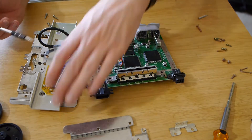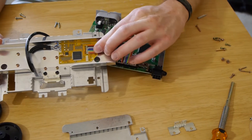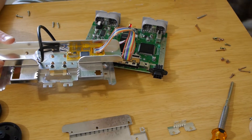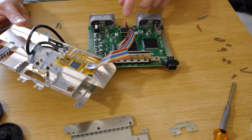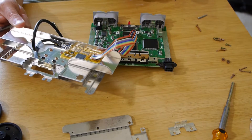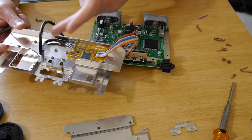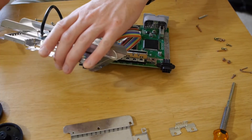The next step is to solder it in the same fashion to the actual N64 RGB board. I've already done that here, of course. Normally you would do this with the board outside of the N64. And then the final step is to solder the board to the multi-out jack. So this is an all-digital connection — this is where the analog connection starts happening. If you've seen my comparison video, you might understand why I tried a better-shielded wire here, because it looked like there was some interference happening in the video signal. Turns out it didn't help, and switching to a nicer cable didn't really help either, so I think that's just inherent.